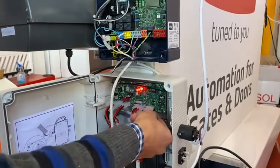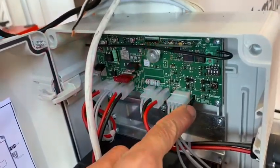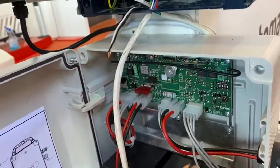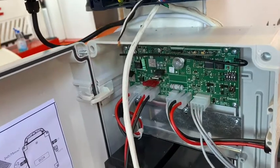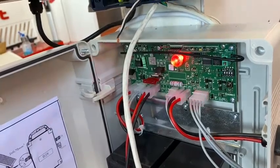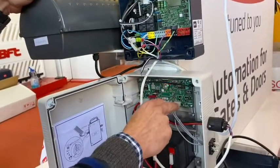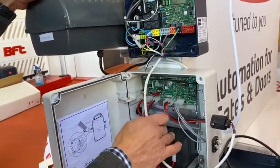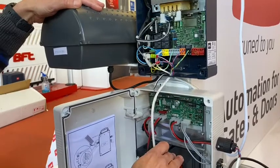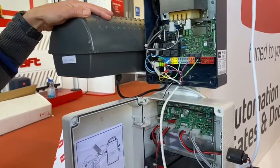The last step is this little jumper just here. It's sitting on the bottom leg — that's how you'll generally find it. When it comes to tuning in remote controls, it is imperative that we do not tune in remote controls onto the control board of the motor, but we tune them in to the control board of the EcoSol. The idea is that the control board on the motor goes to sleep and the EcoSol is what wakes it up, so there's no voltage leakage, to try and preserve the batteries as much as possible.